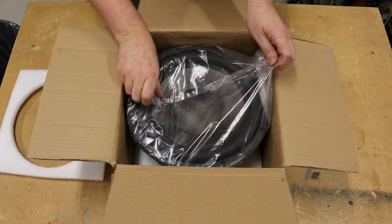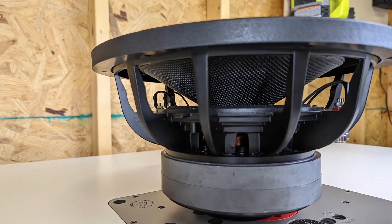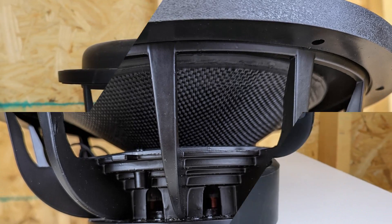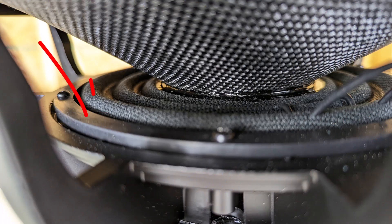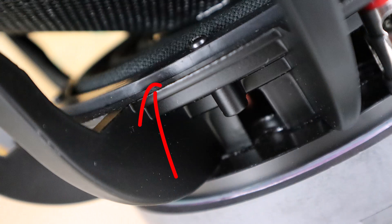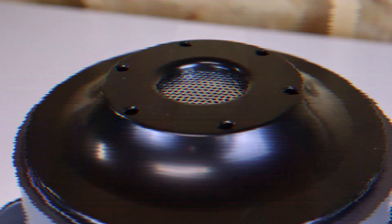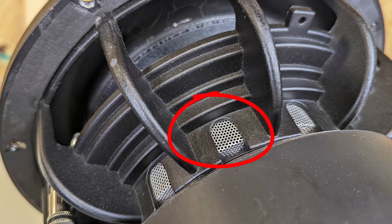Here is the subwoofer, and it looks kind of cool. It's got a carbon fiber cone and a carbon fiber dust cap — and yes, that is the real thing. Carbon fiber is light and strong, and I'll show you how strong in a bit. The basket appears to be cast aluminum, not stamped. It looks really familiar — there are several subwoofers that use a very similar frame. Here it is next to a 10-inch Dayton Audio Ultimax, and the basket looks almost the same. A key difference is that the Light Harmonic has a ring that holds the spider to the frame. It also has insulation on the tinsel leads, a nice pole vent, plus perimeter vents on the bottom of the magnet, so it looks like it should have plenty of cooling. Here's a nice shot of the three-inch voice coil peeking through this arch-shaped vent — the Ultimax has the exact same arch-shaped vents, but with a little grill over them.